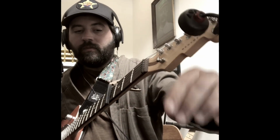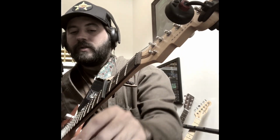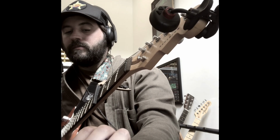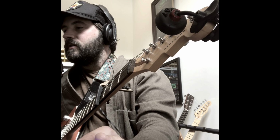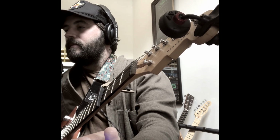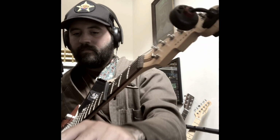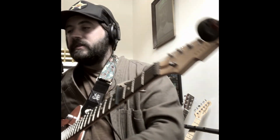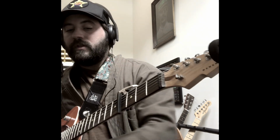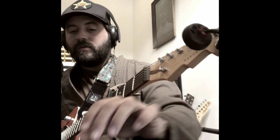When you combine both of them, so we've got the fuzz section at 0 saturation, and watch what happens when you crank the reverb volume. You get a lot more breakup from the fuzz. Not to mention, your volume doesn't increase because the fuzz is at the end and the fuzz volume is still at 50%. So you can increase the reverb volume all you want, but the volume doesn't get louder because you're choking it off at the end with the fuzz.